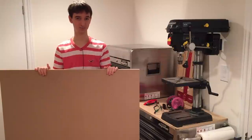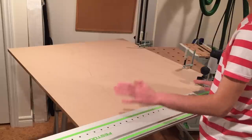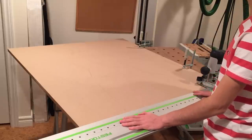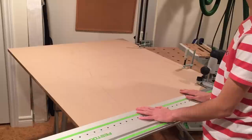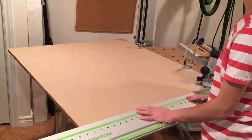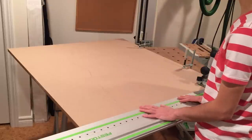Without more to say, let's bring out the LR32 system and make the jig. I've got the 55-inch LR32 track clamped down to the short side of this 4-foot by 3.5-foot sheet of 3/4-inch thickness MDF. The exact placement of the track isn't important as long as the uncovered surface is at least as large as the MFT top.